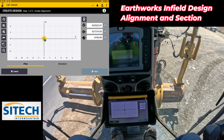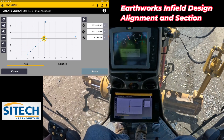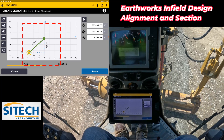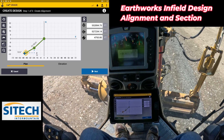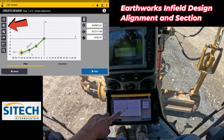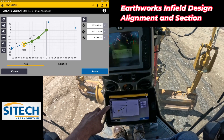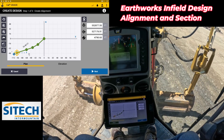Now that I've recorded one, I'm going to back up and make a couple more points as we go down through this road. I'm not as worried about the elevation at this point — it's more about just getting the alignment. I'm going to hit the plus icon and you can see every time I do this I'm creating points. The more points you take when you've got a bend, the better. When you straighten out, it's not as big of a deal. Every time I set down it's creating a northing, easting, and an elevation — you can see that on the right side — but I'm more going for alignment.